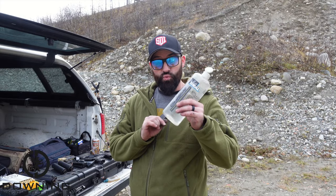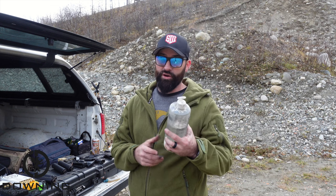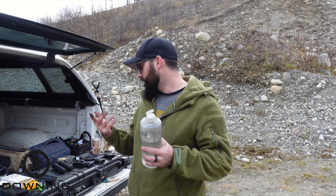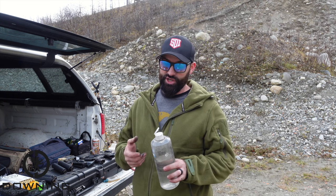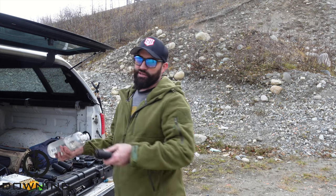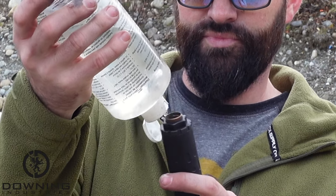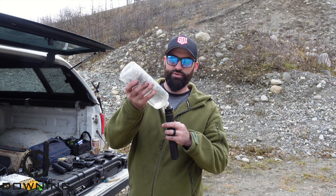What we're going to do now is wet everything. I prefer to use wire pulling gel — it's basically a water-based lubricant, kind of like thick snot water. It burns off relatively quickly and does a pretty good job. This is also going to be a really good way to test and see how much back pressure each one of the cans has. Scientifically, I'm going to measure an exact amount — about that much — and put that in each one of these cans, then shoot them.